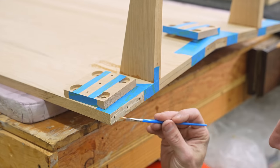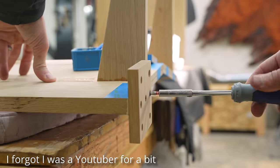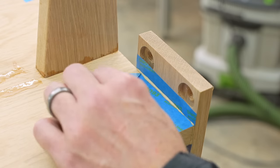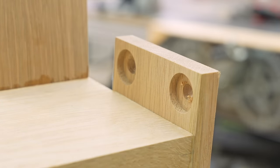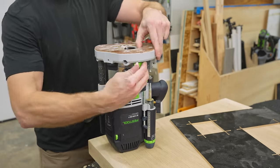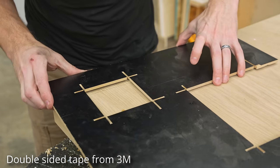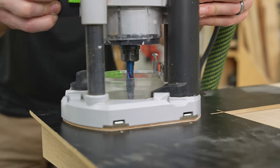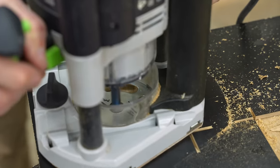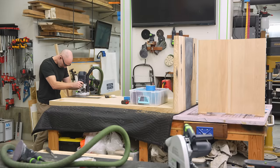Scott came up from editing and noticed I'd added a lot to this — I didn't get any footage of the gussets. Those gussets are to help with side-to-side stability, and these are just simple mounting tabs. I was going to use metal but thought oak would work just as well and look cleaner. If you're a new woodworker or even an experienced one not using router bushings, I highly recommend them. A router bushing set might cost about $25 and works for all price levels of router.